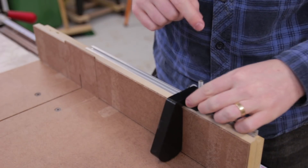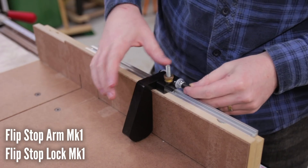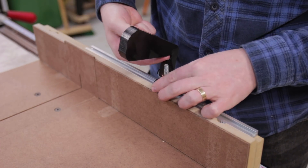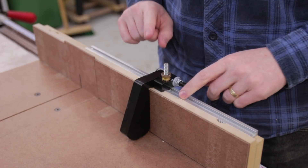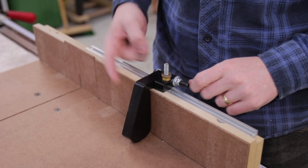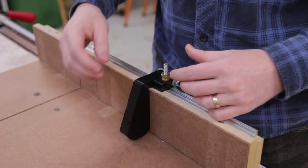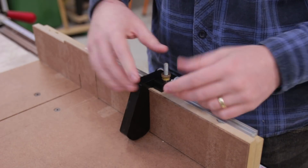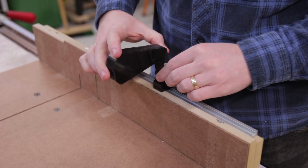The cut for this was pretty good. I had to drill one hole for the lock nut. I did have a few issues when I resized the fence — just a few millimetres — that I had to cut out this section here so it would actually sit properly. That works well, but there is one major flaw with this type of flip stop: it has too much play. I'd rather eliminate all the play that I can. This is a problem that not all commercial flip stops actually solve either. There are probably three different ways we can go about it.